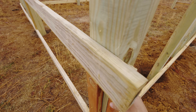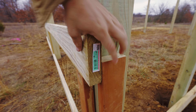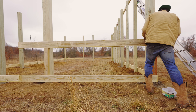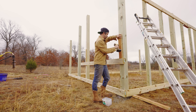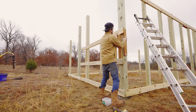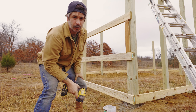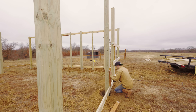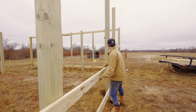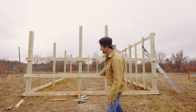I'll just get this board, which will be my spacer right here so I know how far it goes out, and then just push that board over. Right there. Get your spacer again. For everyone wondering, I'm only putting screws in for right now to get it all where I want, and then I'm going to come back with the nailer and nail it all in. Nails are way stronger than screws when it comes to stuff like this.